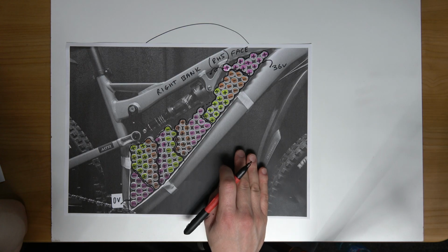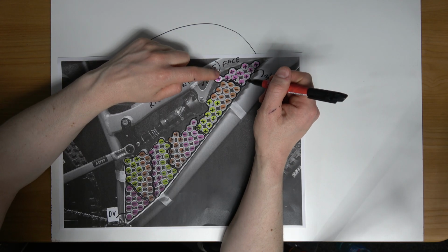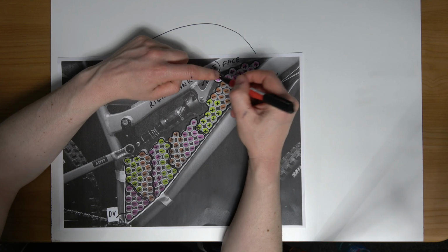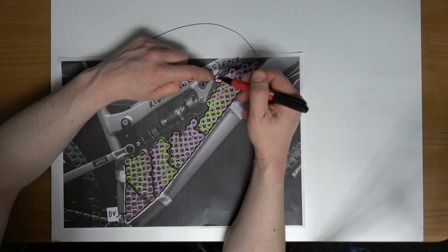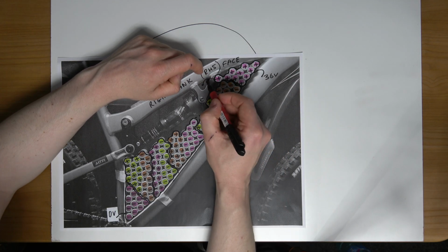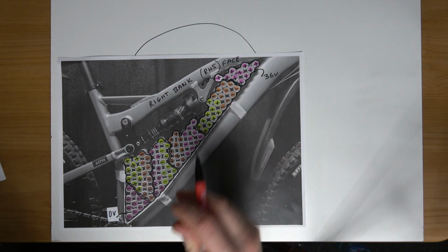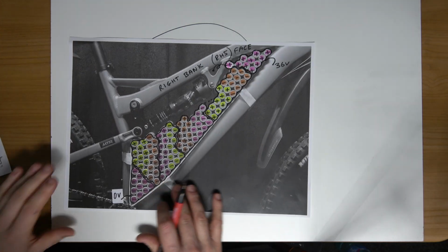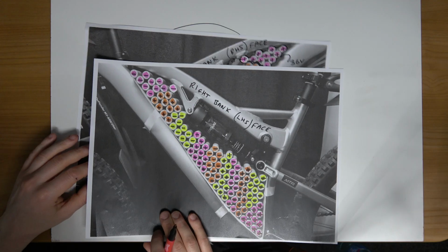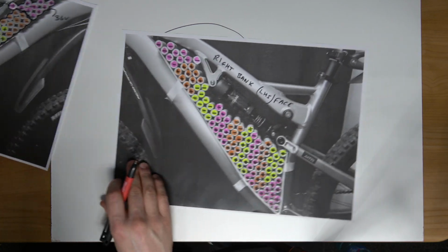So just want to point out now, this last plate, this last group even, will be one plate over 10 cells. So there will be a series connection, a terminal at this point where I can connect on a high current cable, tri-rated cable, so I can run it through the bike frame to the left bank. So we're going to mark out the rest, and then I'm going to wrap up here. So came together very well. The left hand side face will be identical to this one. So I'll just mark it out here.